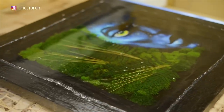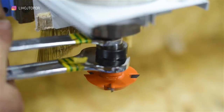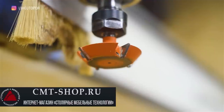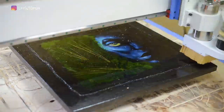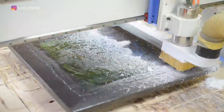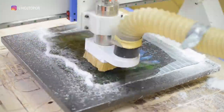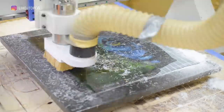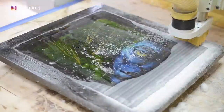After 7 days, we return to the countertop. As you can see, it is already on the CNC, which means it will be calibrated. With the help of the CMT cutter, we calibrate it, removing half a millimeter per pass. We were afraid to overdo it and remove more than required, so we decided to make an extra pass and not open the sample made for the Levitron — it's only 3 millimeters to reach that sample.